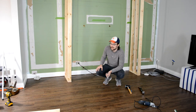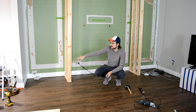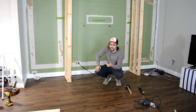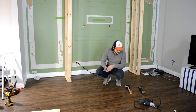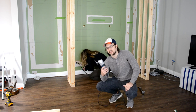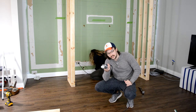To make these flush up against the wall we have to remove the baseboard first. We'll eventually need to remove the baseboard on the side for the cabinets too, but for now we'll just focus on the back piece. We're going to cut the top of the baseboard that's caulked with a utility knife to break the seal, then use a crowbar to pull it off. We're also using an oscillating tool with a cutter on the end to cut the edge very finely and precisely.